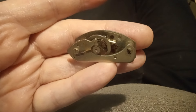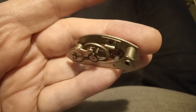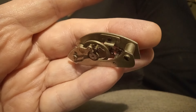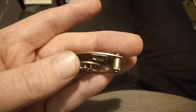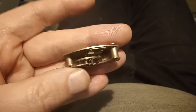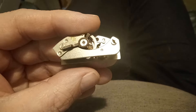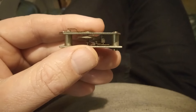This is the escapement I'm looking for, for an FM Zonneberg striking movement that I'm trying to rebuild — not the FM Zonneberg clock you've seen, but another one you haven't seen. This escapement is East German, has a pin pallet lever escapement, and it's not exactly a platform — it's more of a kind of cartridge. My old Halberstadt wall clock, which I don't have anymore, had this same arrangement.